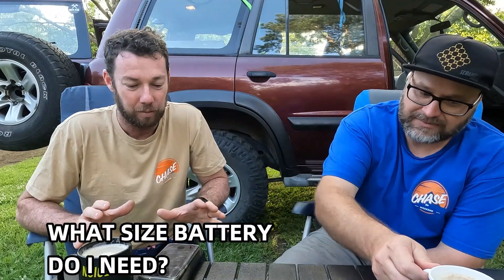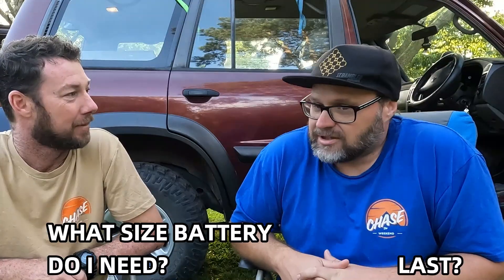The first question I see all the time is: what size battery do I need to run my fridge, and how long will it last? Well, the battery size really depends on what you want to run and how long you want to go away for — how long you want to be off the grid. 100 amp hours will get you through a lot of situations; it'll run a 12 volt fridge, some lights, a few things like that. If you want a bigger setup and run inverters, you're probably looking at three or four hundred amp hours of storage.